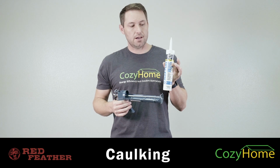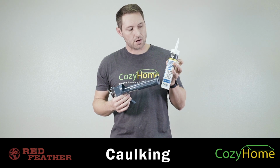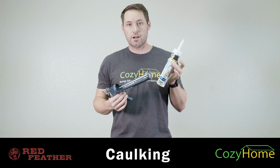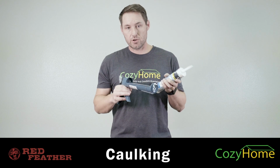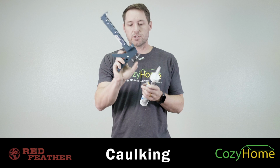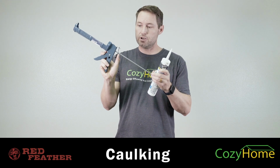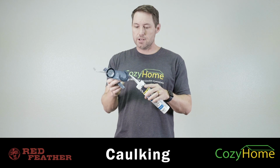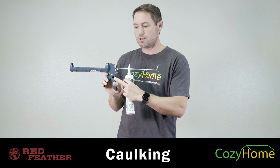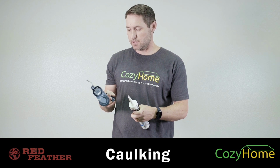This particular caulking tube is white. Other ones, you can buy it in clear and brown and other colors as well. But I'm going to show you real quickly how to load a caulking gun. So first off, you want to push this button on the back of the caulking gun and slide the plunger back. And then what we need to do is cut the tip of this tube off. There's a little cutter that's built into this caulking gun that you can use. You can also use a knife to do that, or a scissor sometimes works as well.